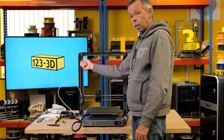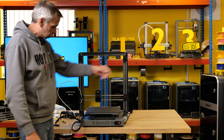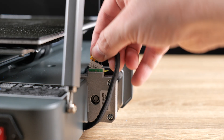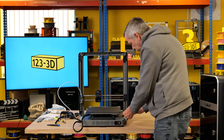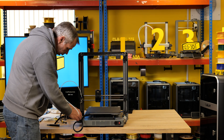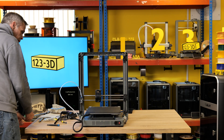You literally then just push the screen into place — done. We have these little gizmos which are braces. There's a little tab sticking out the back of the frame labelled 'R' for right, and another little tab labelled 'L' for left. Before putting the braces in, I'm going to plug these little cables in. This cable is labelled X for the X-axis — pop that into the stepping motor, make sure it's pushed home and seated correctly. This one is labelled Z-axis, so again this goes into this stepping motor — make sure it's pushed in. Now we shall proceed with the braces.